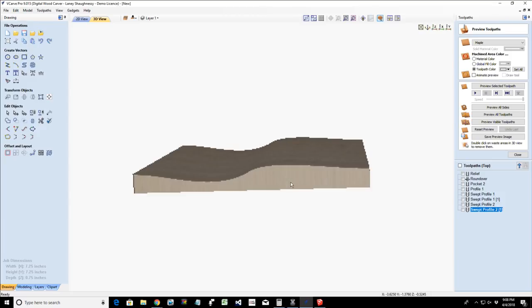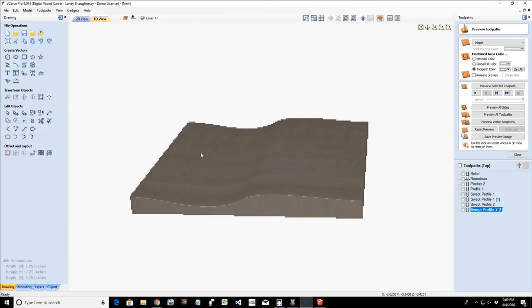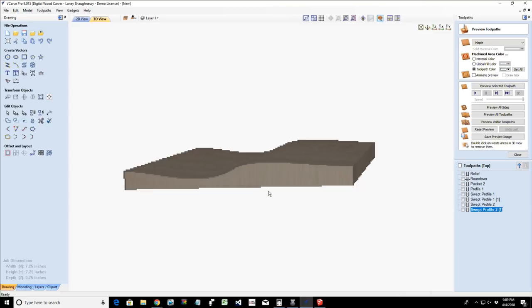Well, basically, we are taking our board and milling off a curve in here, creating the form that would be used in a bent lamination technique. But our form is part of our project. So we would have our veneers, our thin pieces of material, maple or what have you, in here, and then a second board cut to this shape, and they would all be glued together. Now, typically with a normal bent lamination, you have a form that gets released, and then you've got your bent lamination. Well, we're laminating our two halves and our center band all together, gluing it up.